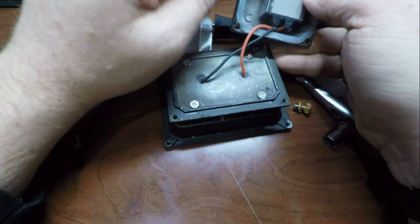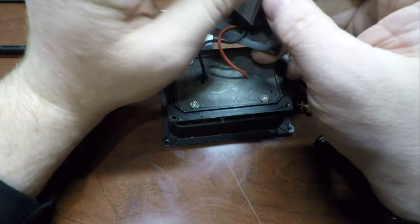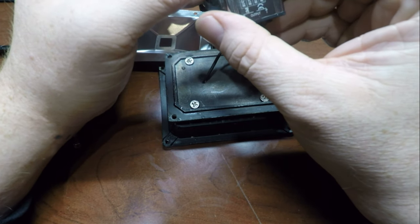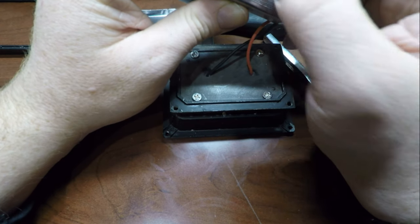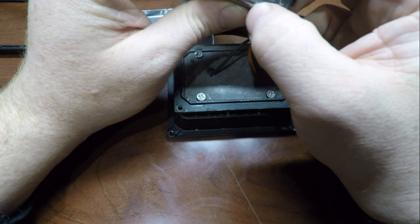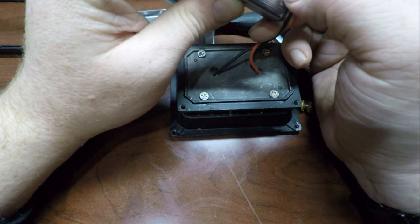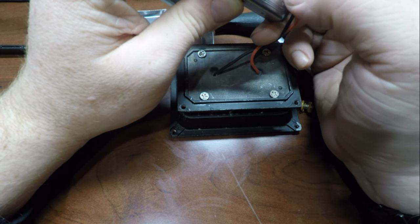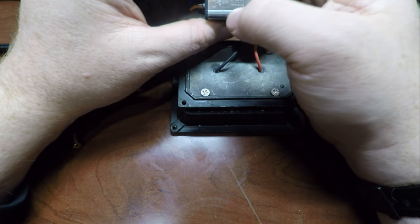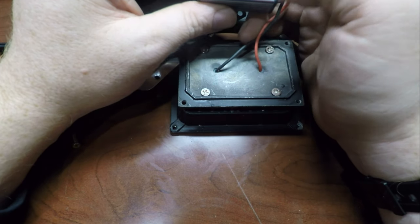And what do we have? This is exceedingly simple. Looks just to be an LED driver here. Input AC/DC 12 to 24 volts, 2 amp. Output DC 16 volt. It looks like this LED, depending on the voltage sent to it, actually varies in the power it receives — rated 5 to 12 times 1 watt.